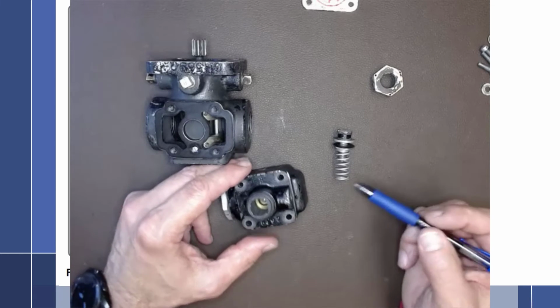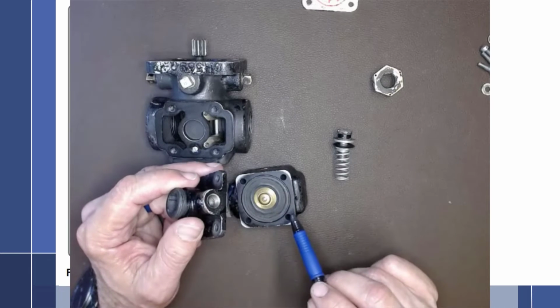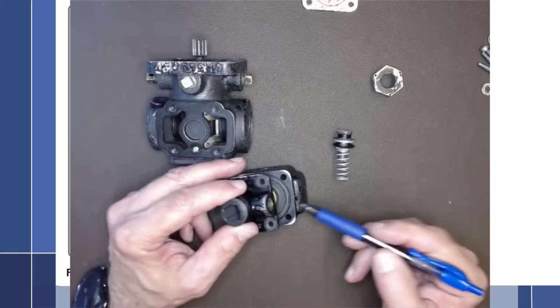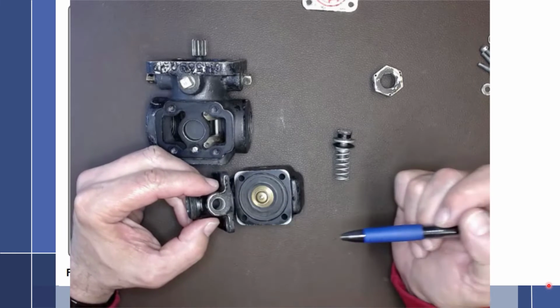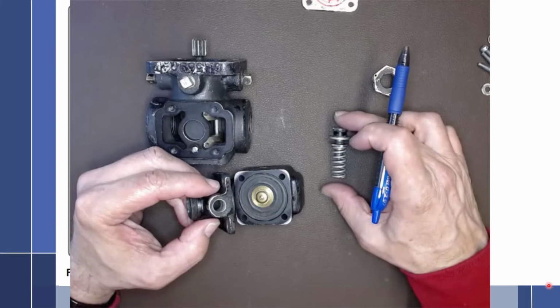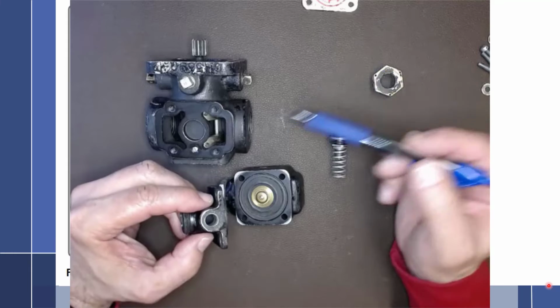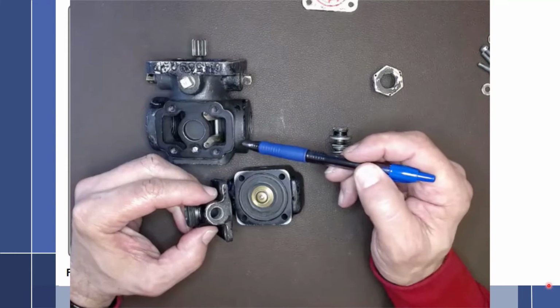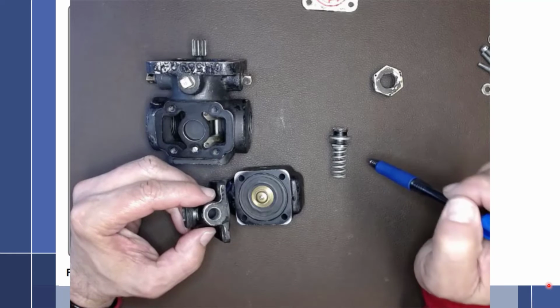And the atmospheric pressure down low would have a little assist on here, and then when we go up in altitude and the air pressure decreases, it would be less of an assist. And when the vent plug is attached to a turbo or supercharger upper deck, what happens is we add more throttle, the engine is going to speed up, the pump will speed up because it's attached to the engine, but the pressure from the turbocharger has yet to spool up.